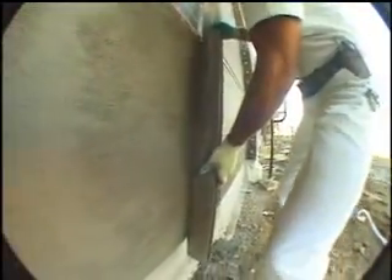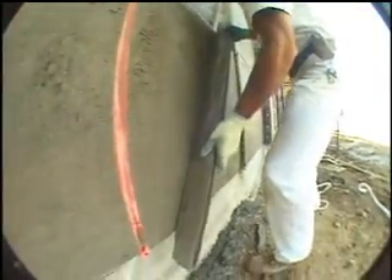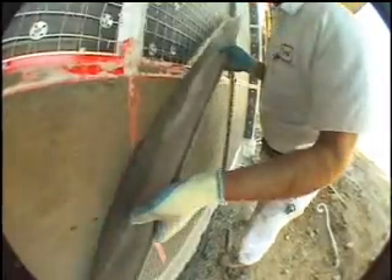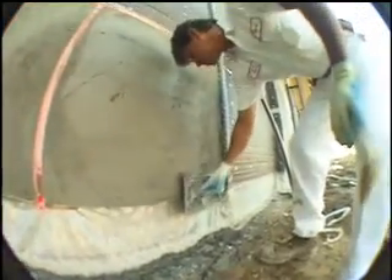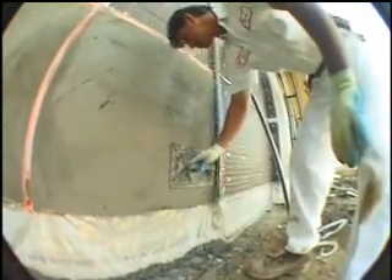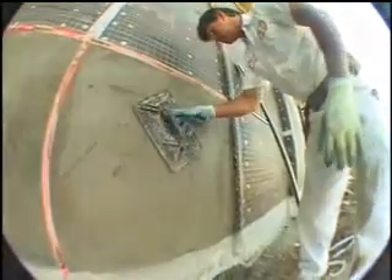After hogging it on and rodding it off, we wait about 45 minutes and come back to start trimming it — using the edge of our rod and/or the edge of our trowel depending on preference. He checks the screen just to make sure all the nooks and crannies are filled, and pretty much we've got a straight, consistent wall perfect for color coat or finish application.